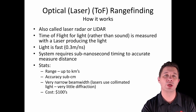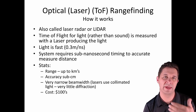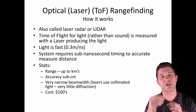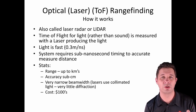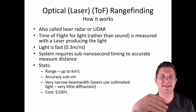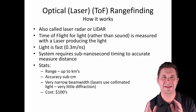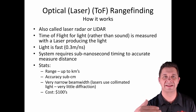Let's move to something higher tech: time-of-flight based LiDAR sensors, also called laser radars or LiDARs. These use the principle of time-of-flight — detecting how long it takes for light to travel from the source to the destination and back again, rather than sound like sonar. Light is very fast compared to sonar, which means we need super-fast processing and really accurate timekeeping. For a range of a metre or two, we're talking nanoseconds or sub-nanoseconds of timing accuracy needed to accurately determine distance.